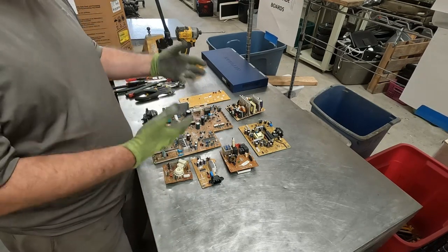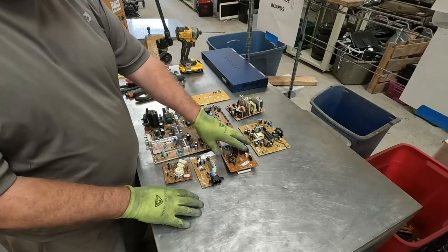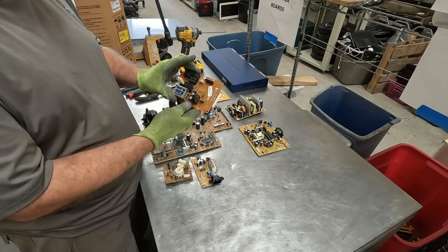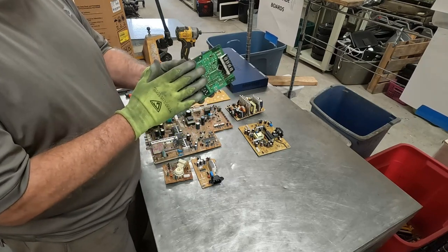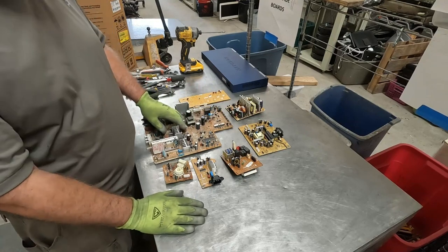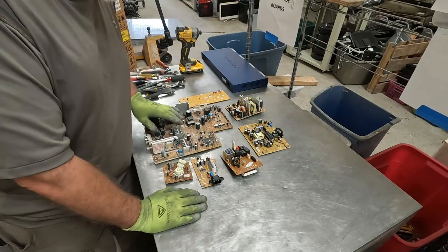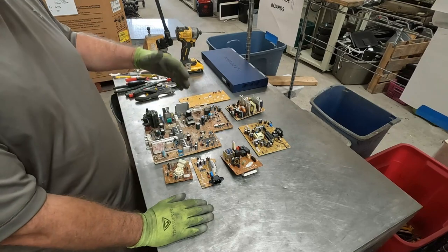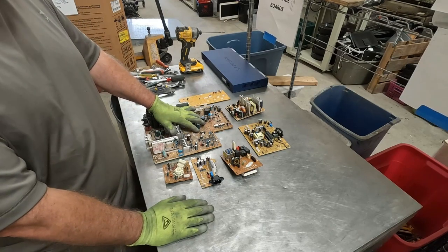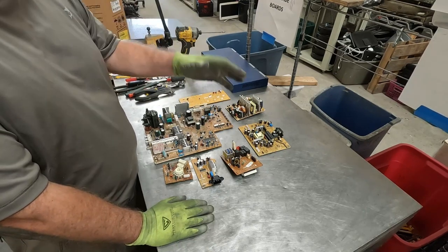They would call them low-grade boards. A more sophisticated e-waste buyer will differentiate, and they will say, 'Well, wait a minute — it's brown, it's green, it's got circuitry on it, we're going to put that in mid-grade because there's more to it than just the power part of it.' Boardsort.com is probably one of the most sophisticated e-waste buyers in the United States; they set a standard that other e-waste buyers seek to achieve. For boardsort.com, the low-grade board is really easy: brown brittle board is low-grade; brown-green or green with big transformers and stuff is mid-grade.